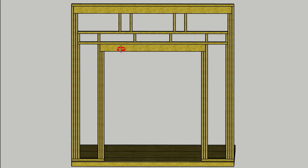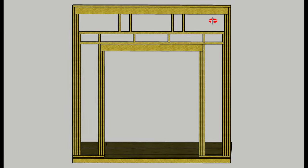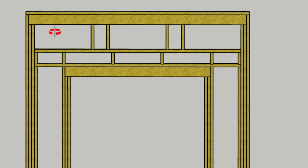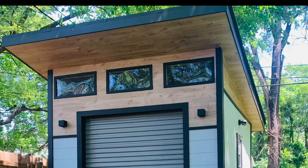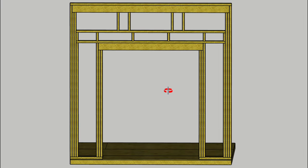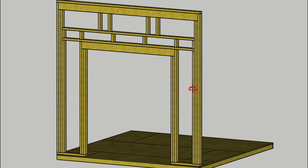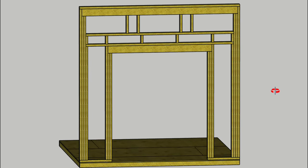So when planning out your front wall, you're obviously going to need a header over the door's rough opening. In our case, we have a 6-foot wide roll-up door that we installed, and you're also going to need a header over the top to distribute the weight over the windows. The wall studs are going to be 2x4s and our headers are going to be 2x6 lumber. Plan out your front wall layout depending on the size of your door and how big your overall shed is going to be. Feel free to use this 3D framing model as the basis for your shed, but if you want the exact dimensions I used, you can check the link in the description.